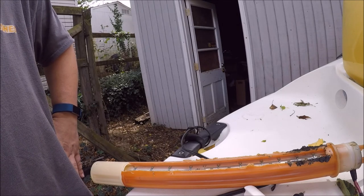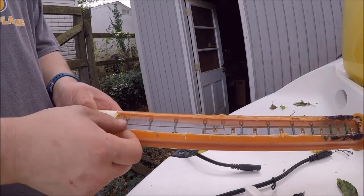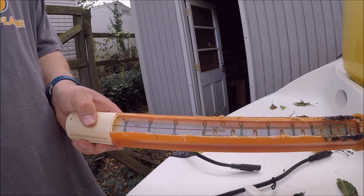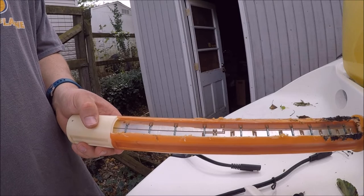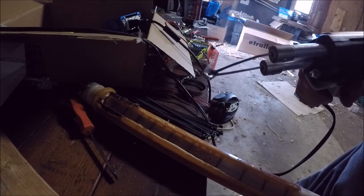I'm going to go ahead and weld the other piece back on here that I took off — this giant chunk right here. All I'm going to do is heat it up with a soldering iron and use zip ties as kind of a solder or weld. What's good for that is the Weller soldering iron — it's kind of like a pistol-grip type gun, and it has a flat tip that comes with it, which is really great for putting these two pieces back together. We're now in my garage. This is the Weller soldering iron I was talking about — a really nice one. What's really important is this flat tip — it's going to help you better solder the plastic on there.